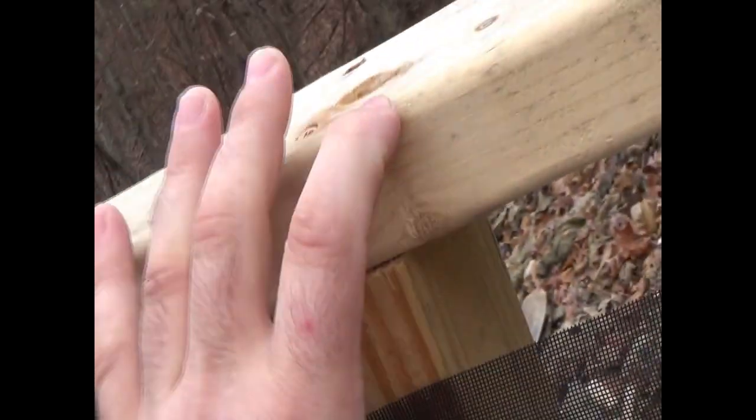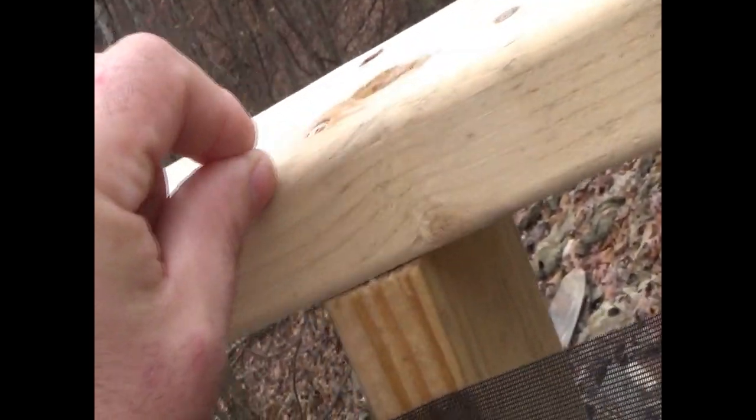And then I'll just take some 1x4 and butt it up, you know. So that 1x4 will fill this gap back of the rafters and cover this. They'll give it some more staples. Bottom will get some drip edge, you know. I just needed to put the screen in so I could do the drip edge over here and then the siding.